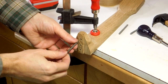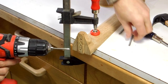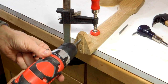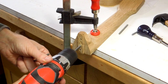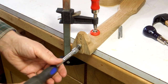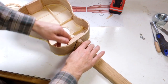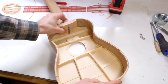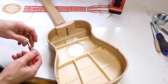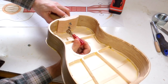I drilled the pilot holes for these screws on the small side because I want a lot of thread engagement. But to avoid splitting the neck I made myself a sort of screw tap by taking one of these hanger bolts and grinding two notches into it, so now I can use this with my drill to tap out these holes. I had a less than perfect fit with the neck, so I had to drill these out a little bit to get this to really fit on there. Now from this side I just put on the nuts - this is easy enough when there's no back on the instrument, but once the instrument is put together I have to do this through the sound hole. The tricky part will be to use a small nut driver and put the nut onto the screw, and it looks like I should be able to do that.